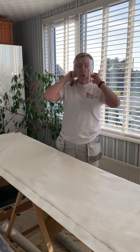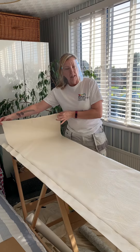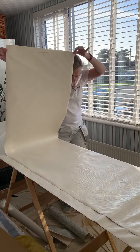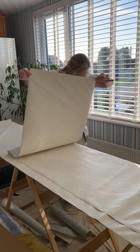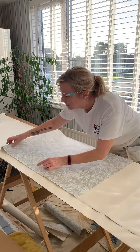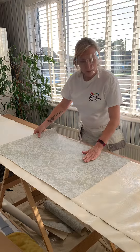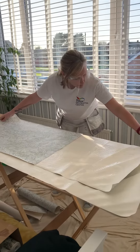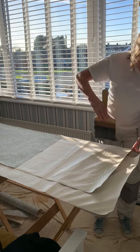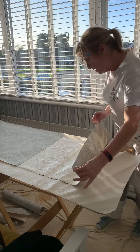The fold for the finished paper then — it doesn't need to be concertina like lining paper. It's called a two-third and a one-third fold. What you do here: you get what you've pasted on the board, lift it up, check that edge, lower it down so it's touching, drop it down like that. Don't leave your edges exposed because they'll become dry edges. This bit then goes up like that, because if we drag it along it might get paste on it. Tap this bit down and paste the top edge, which is the bottom actually. We know that's the top because it's got a T on. And then take that to there.